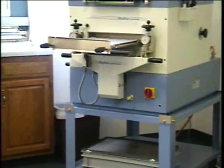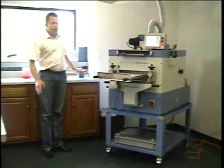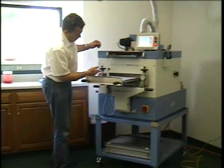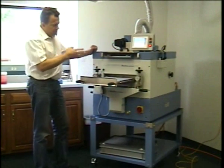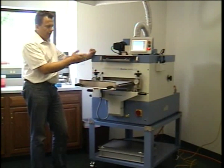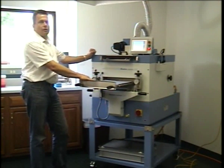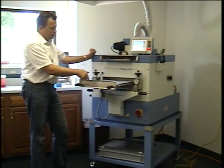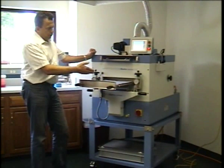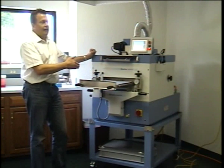So next is coating. So first we want to determine how much do I want to add coating. So we know 0 is knife touching the roll, so we got to consider the substrate being the fabric in our case. How thick is it? Plus whatever coat weight we want to add.